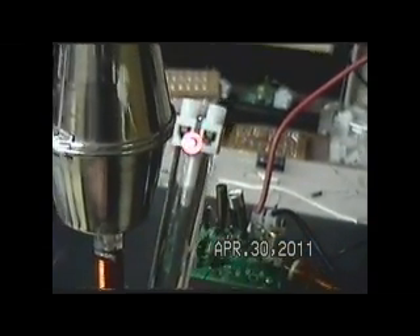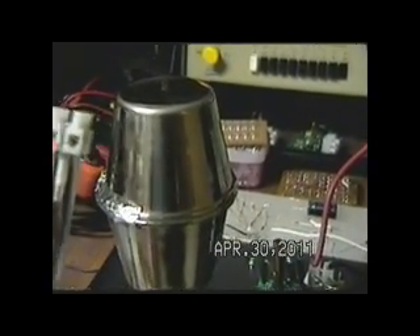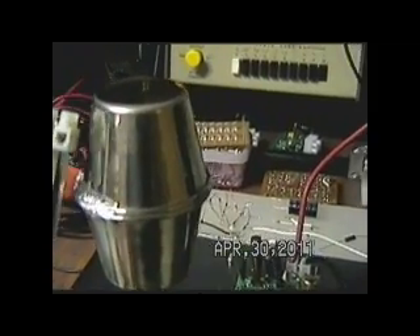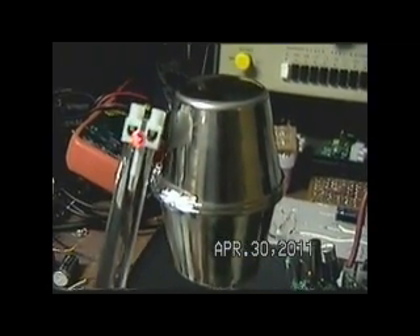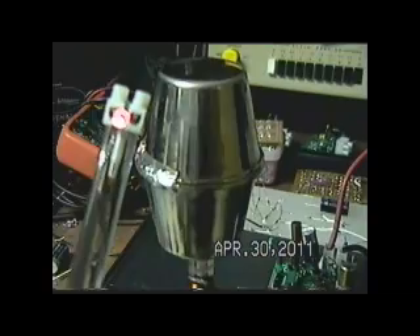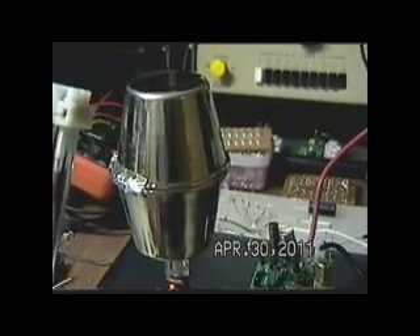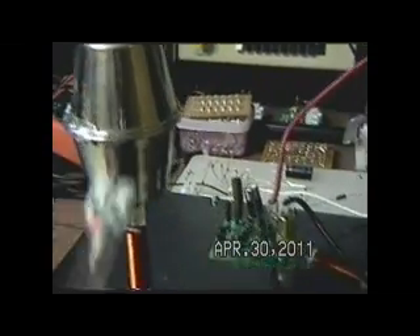And now move close to the tower. You can see that as we move around the tower, we actually can pick up a fairly good signal. Notice that as I'm close to this tower and pull away from it, you can see that the maximum field is not the closest to the tower — it's out about right there. So actually the diodes are probably about an inch away.